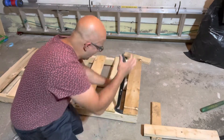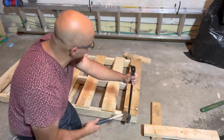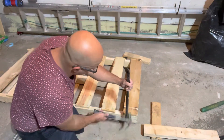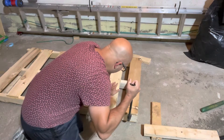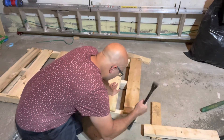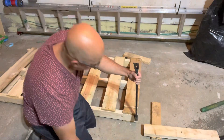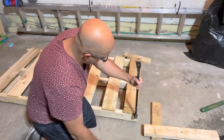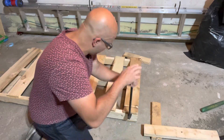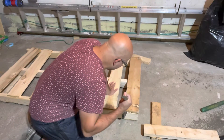There we go — I can pry it up a little bit now. The main goal is to do it without damaging the wood. I'm just making my way closer and closer to the middle. I do see a little bit of breaking, but that's fairly normal for that to happen a little bit — you want to avoid it if you can. Another tip is to actually get the crowbar underneath the nails. Instead of just prying up the wood, you want to pry up the nails completely. Don't just pry up the wood — you want to pry up the nail itself.